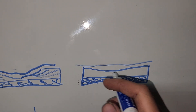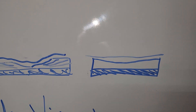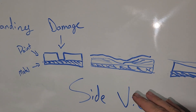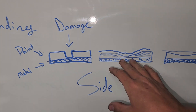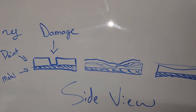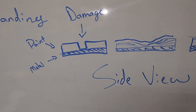If you want to get fancy, you can actually spray powder into that area like a filler or primer, re-sand it flat, block it out, and reapply another layer. The main thing when using the sanding technique before adding more powder is to get rid of all the gloss on the paint. If it's flat or satin, scuff it up really good. We use 320 sandpaper; if it's really deep we may go to 180 and work up to 320. If you're hand sanding straight you may put straight scratches in, so you may want to take it to 400 grit.